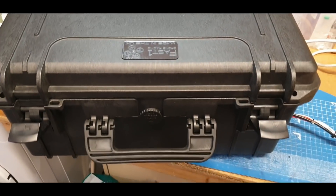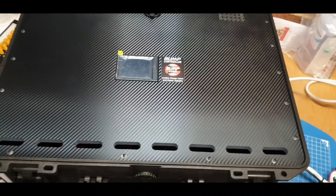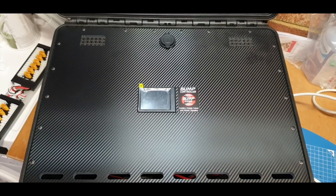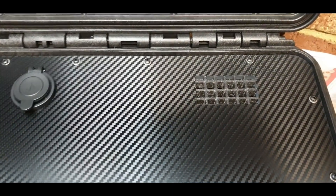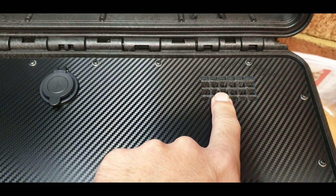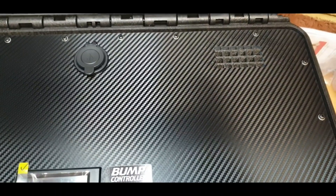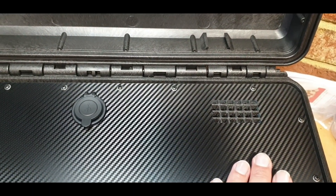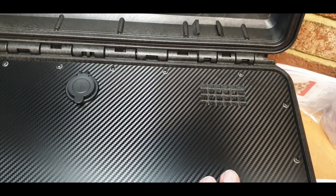Let me open the lid. As you can see, very minimalist this one - we're not looking for anything flash, it just has to be reliable and functional. As per normal, we've got my usual 9733 radial fans. You can hear them pushing the air out - they do shift an awful lot of air. In fact when you cover the air inlet slots with your hand across the front there, you can actually feel the air being sucked in, it's quite good. So there's very little chance of the charger and the power supplies contained within this lower half of the case getting too warm.